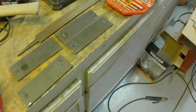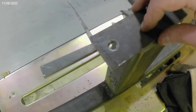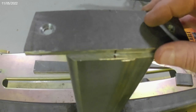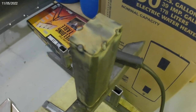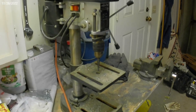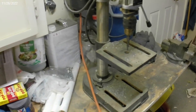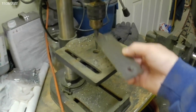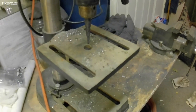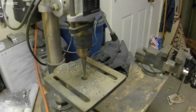We got the mid-size holes drilled, but when I started working on the half-inch hole I buggered up my bit, so I'll have to save that for my nice bit at home. We're going to go ahead and weld these caps on — I've got the center marked on both pieces, and this end cap is already tacked. We'll get all three on and go back and forth between them so they don't overheat. A couple weeks later, we had the idea that a drill press would be way easier than a hand drill. I just tested it out and punched these holes using a step bit — one of the black oxide Bauer step bits — and it cut through awesome, way better than the regular drill bits we were using. Great setup.